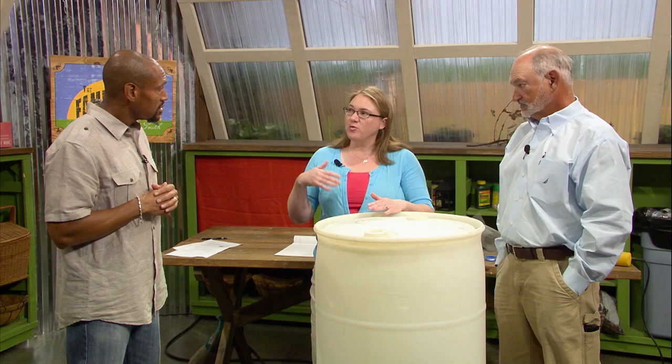When you know you're going to have a lot of rain coming, you want to open up the spigot on the bottom and maybe use a soaker hose or a water hose to direct the water away from your foundation. Because this will fill up so fast that you'll have more than you can handle. So that's a good thing to do too.